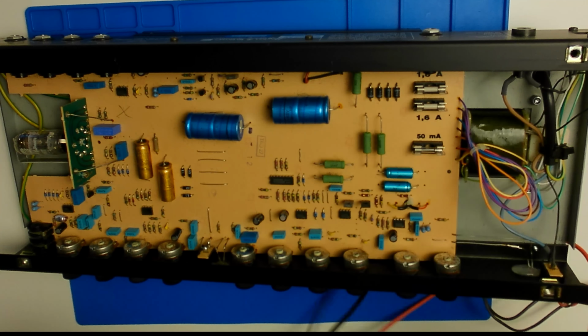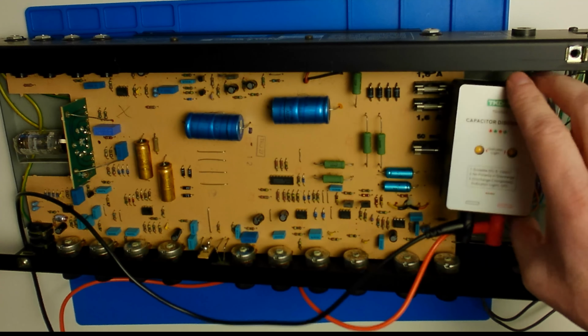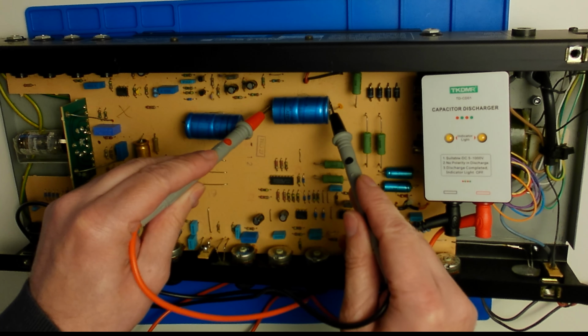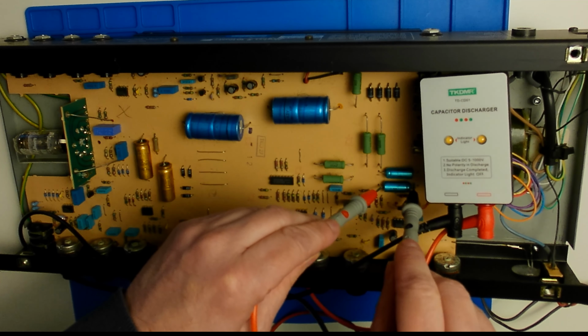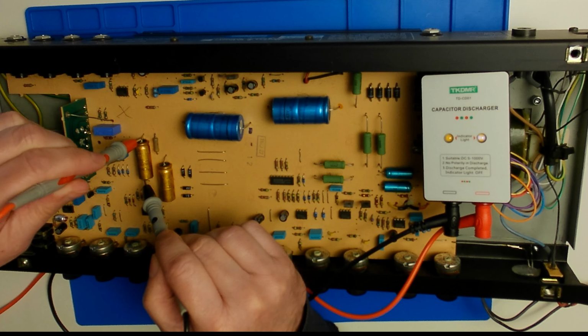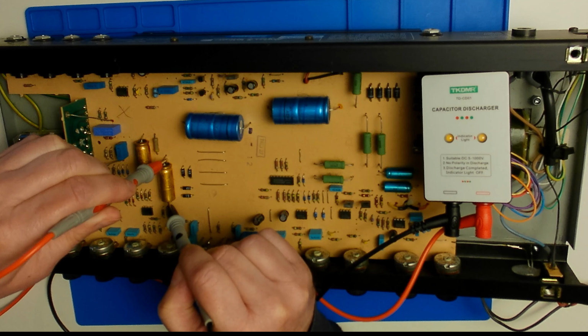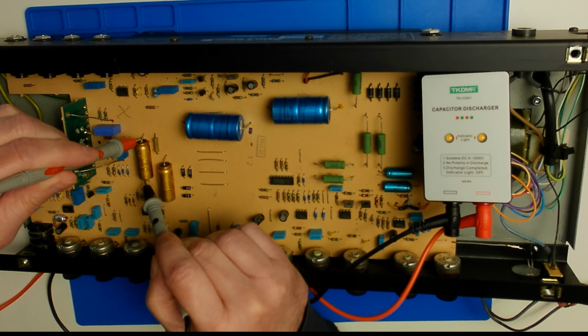After removing the amplifier, we can check the capacitors, which are often the reason why electronics stop working. But first, let's see if we need to drain some of those to prevent any electric shocks. These two 450 volts capacitors turn out to have a decent bit of charge left in them, which they shouldn't have because they should discharge when the amp is turned off. So the path to their bleed resistors could be interrupted somewhere.